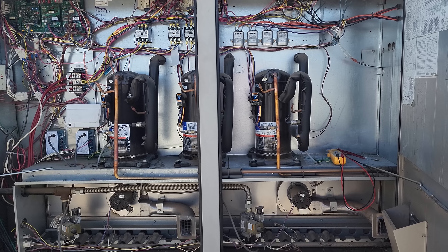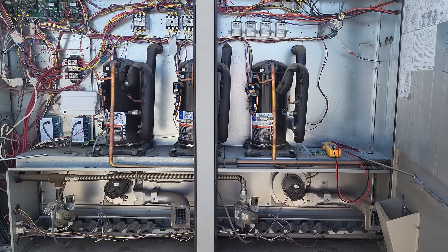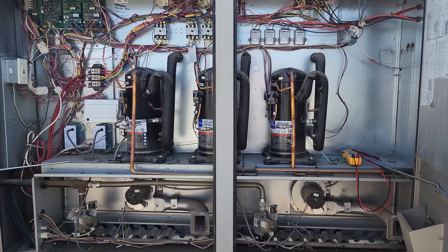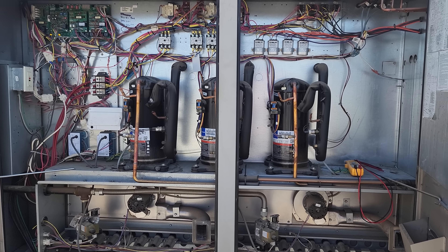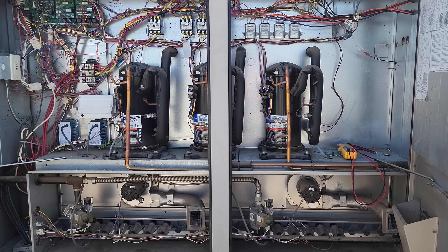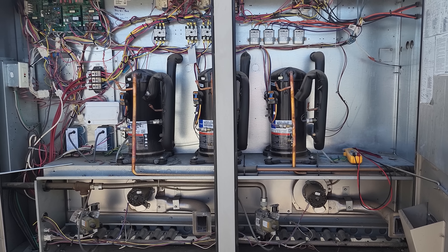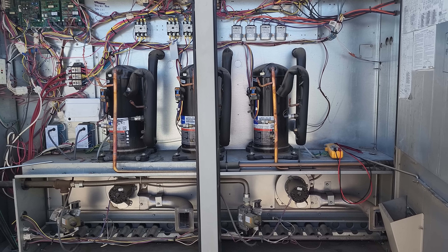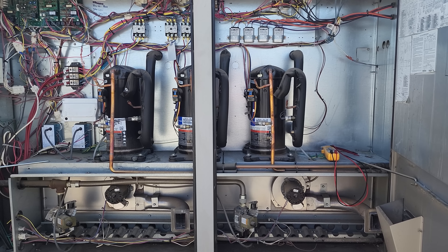This particular location has a lot of blowing sand, it gets extremely hot — we're out in the Southern California desert. Motors go bad once a year. They just overheat, the bearings cook, the oil goes away. Capacitors fail a lot, all kinds of stuff.